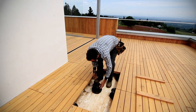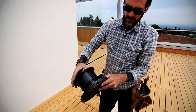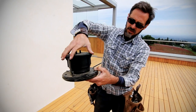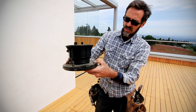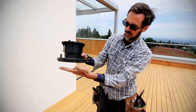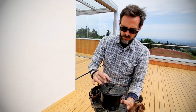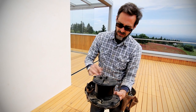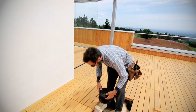What allows us to do that is these pedestals, made by a company called Bison. These little guys have tons of adjustment — you can take the tower, unscrew it, and it jacks up and down. The lower portion is tapered in two different directions so you can account for the slope of the roof. You account for the slope, then the height. It also has cool little dividers and even a little rubber gasket on top so the tile doesn't squeak. It's a really slick system.